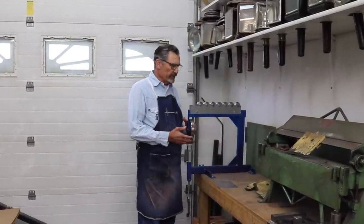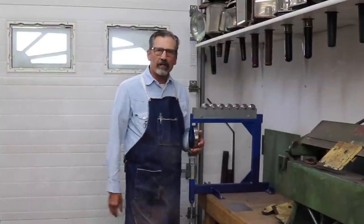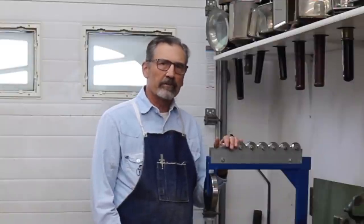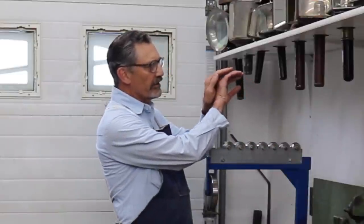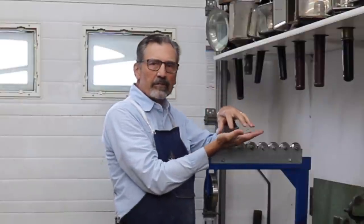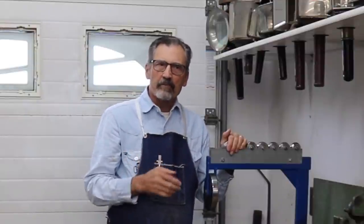In this video, I'm going to use this very basic and small example of an English wheel to form some parts for a pair of Hearse lamps that I am restoring. Now, I'm trying to make doors for these lamps, and there's a couple of unique problems that go into making these doors. First of all, the outer skin is curved and the inner liner is also curved, but I want a space between the two, and they have to fit flat on the surface all the way around the rectangle. Now that's easy to accomplish with a circle, but with a rectangle it brings in some other forces, and that's why we have to use an English wheel.